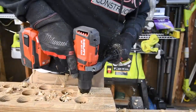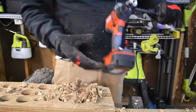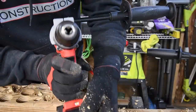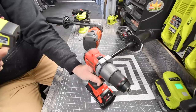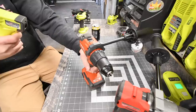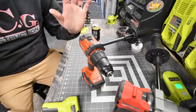Let's take it out slowly. The final test is the battery test. Hilti is at three bars, Milwaukee is at two — so battery life is still fair. Let's do a quick temperature reading. The hottest point on the Milwaukee is 79 degrees. The hottest point on the Hilti is 62 degrees, so the Hilti ran significantly cooler than the Milwaukee doing the same tasks.